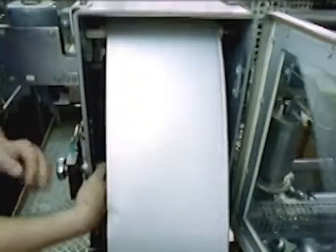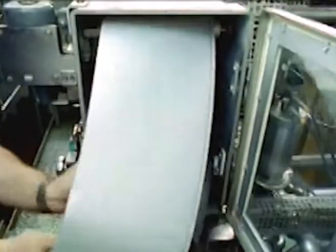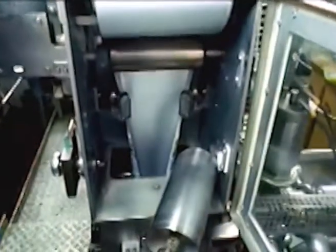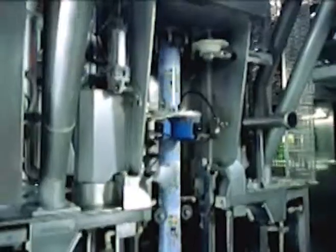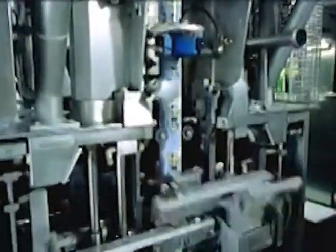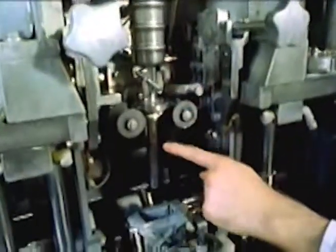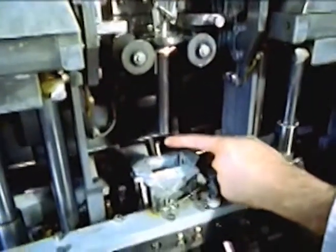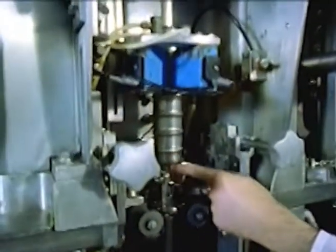The really interesting thing happens behind it — that's where the cardboard is bent. The finished tube then passes to the bottom part of the machine. But how does the milk get into the carton here? Even when you open the machine, all you can see is the tube and some strange-looking grippers. We have to stop the machine again and remove the packaging. The milk runs into the packaging — down at the bottom, the milk flows out of the pipe and rises in the carton tube. To make sure the level of the milk doesn't rise too high, this float controls the flow.